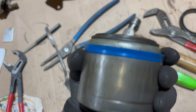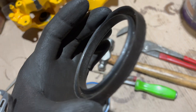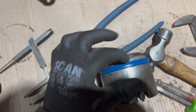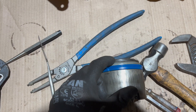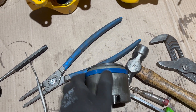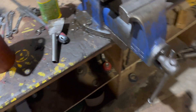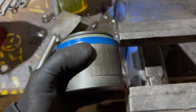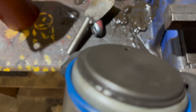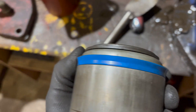So I'm doing a piston seal on the Roadless — the last two I've done were black seals, and that groove seems to be a lot deeper, and that aluminium ring slides in a lot further. So the snap ring goes on. I've had to abuse it a bit — I put the blue seal in boiling water and then quickly put it on, couldn't get it, so I went in with a vice and just gently nipped it, gone round all the way, and heard it snap in. It looks like it's sealed in, so it's going to have a hell of a seal.